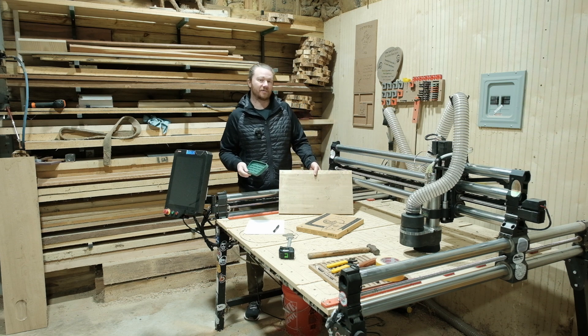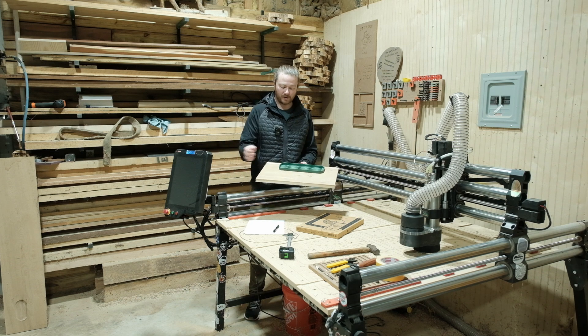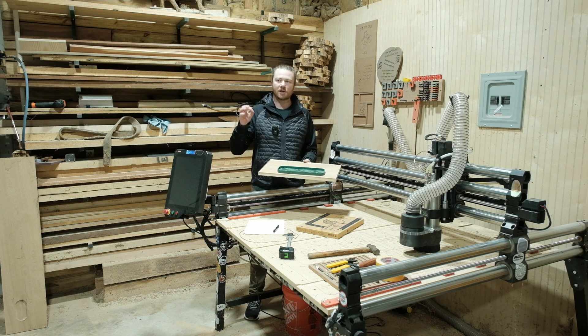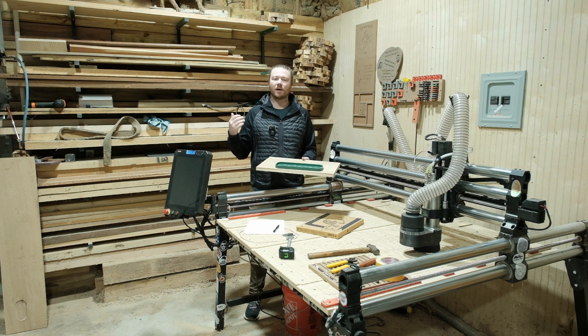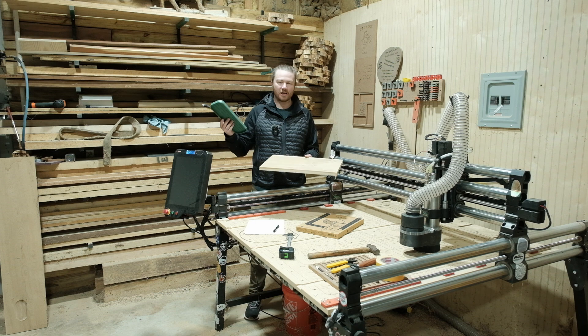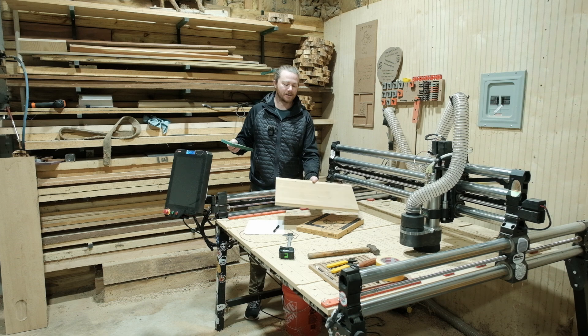Our main project will be cut from a different wood, but for prototyping we're using poplar. We're going to create two versions, differing in the tolerance offset — one at 0.01 inches and one at 0.02 inches — and we'll see which one feels better.